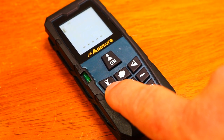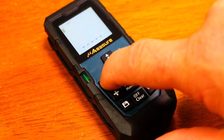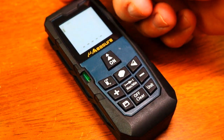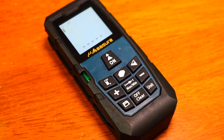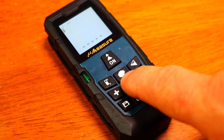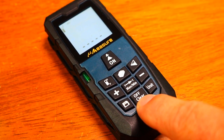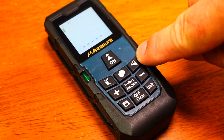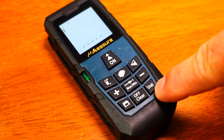The first button in the top left allows you to decide whether you want to measure from the back or the front. You can change that by hitting the button and you'll see it change at the top of the screen — right now it's set to measure from the back forward; hit it again and it measures from the front forward. You have a plus and minus to navigate menu screens and add or subtract measurements. There's a save button in the bottom left. In the middle on top, a button to calculate area or volume. We have a maximum and minimum button, an off or clear button to clear measurements, and a Pythagorean triangle button in the top right. On the bottom you can change the units.